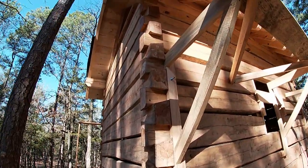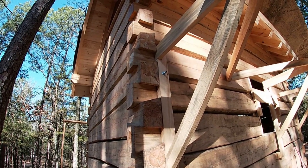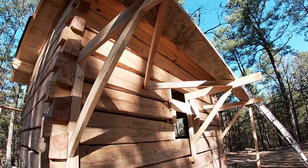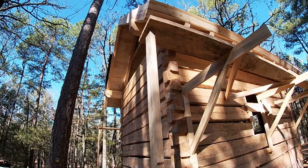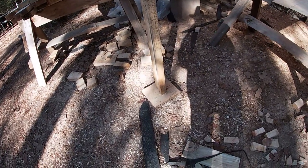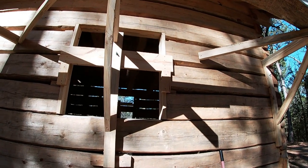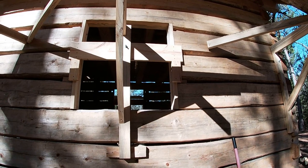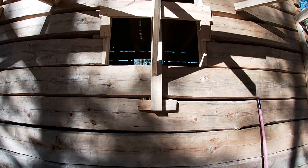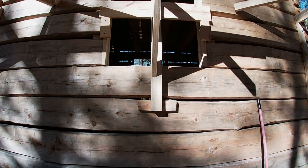I've been working off of these scaffolds that I built. They hang on the side of the building and there is a bolt — a piece of all-thread — that goes through the chinking gap, with a two-by-four block on the inside with a washer and a nut. I brace them so they won't move sideways and use a two-by-twelve for a walk board screwed down so they won't move. On the end I have another two-by-four holding up the end that rests on a block at the bottom so it won't sink into the ground. Where there's a window I had to put a two-by-eight across with a two-by-four block underneath in the sub jamb — a temporary sub jamb — and bring it out an inch and a half to make up for the thickness of the two-by-eight that holds the scaffold jack itself.